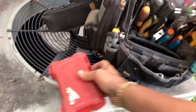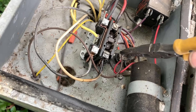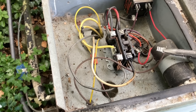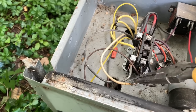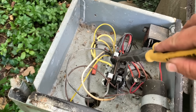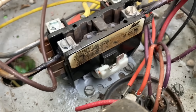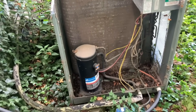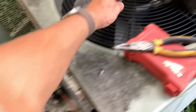Right now she's energized. Let me grab my meter and carefully pull one of our 24-volt wires going to the contactor. She did open. Looking at the condition of the contactor — the wires that are melted — we're going to swap that out. This is a single-pole contactor; it's a shunt. L1, L2, T1, T2, 24-volt coil. Overall condition of this system is fair to poor, but everything is sorted out.